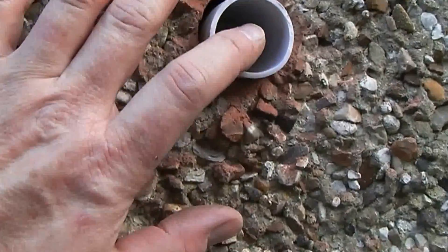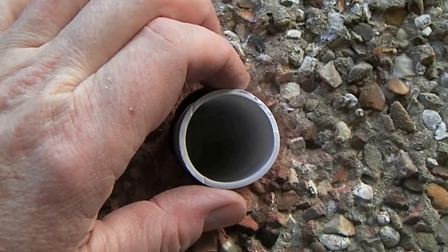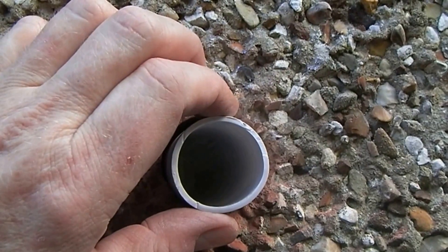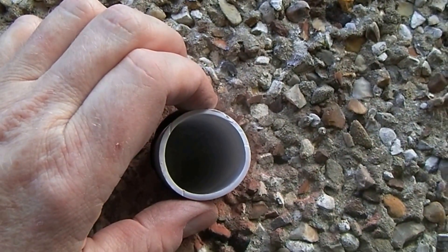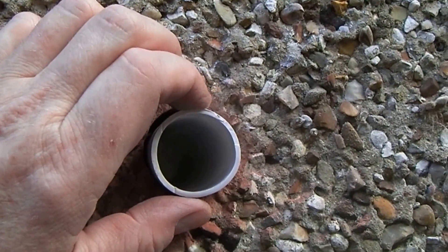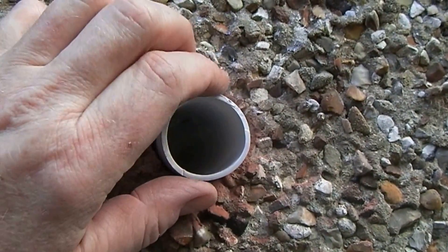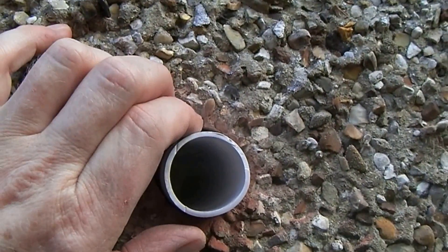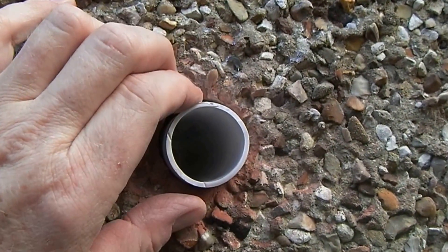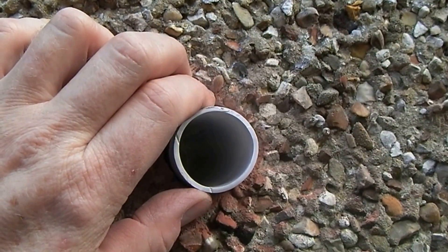Where the 22 mil pipe runs through here there's obviously going to be a gap. I may have to solder on the other end where the pipe exits, so that's going to get quite hot as I solder it. What I intend to do is use some very high melting point silicone sealant — the kind I use in GHD repairs — to get the 22 mil pipe centralized and seal it right in the middle with the high-temperature silicone, so the copper pipe doesn't actually touch the plastic at all. That should allow me to solder on the other end without any risk of melting the plastic.